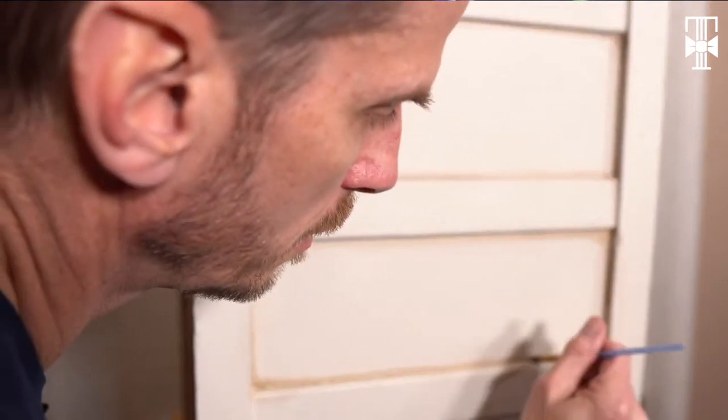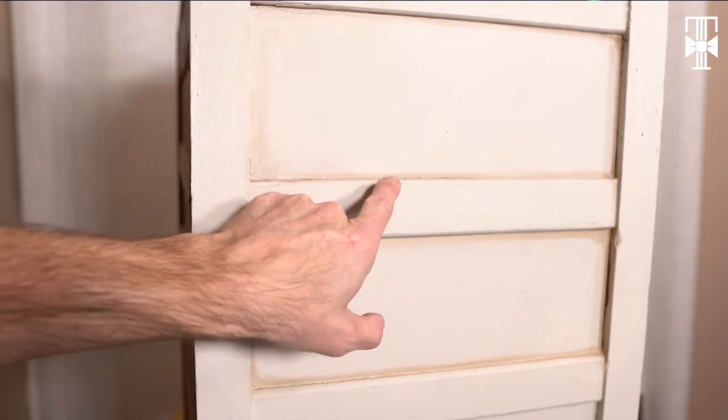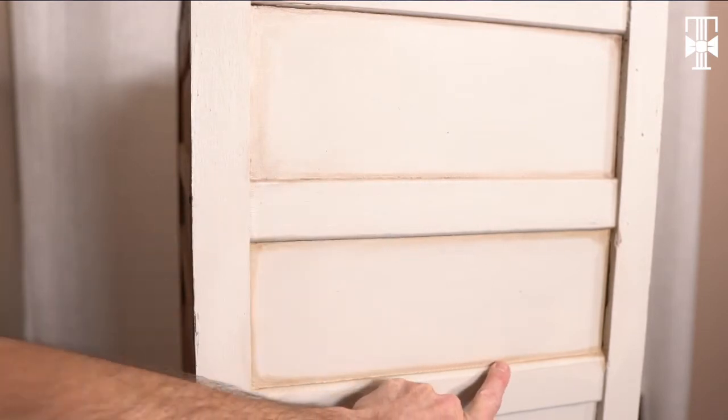That's the difference between Van Dyke Brown and the Voodoo gel stain up there — not a huge difference. Sometimes it comes down to how intense you want it or what you have on hand. Once you really work and blend it, I recommend you let it dry or wipe it off. If you don't like it, wipe it off with a wet rag, because once it's dry it's a little harder to work with — that's maybe one disadvantage. Right now they both look pretty close; this one has a little more of an orange tone, but both gave a nice result.